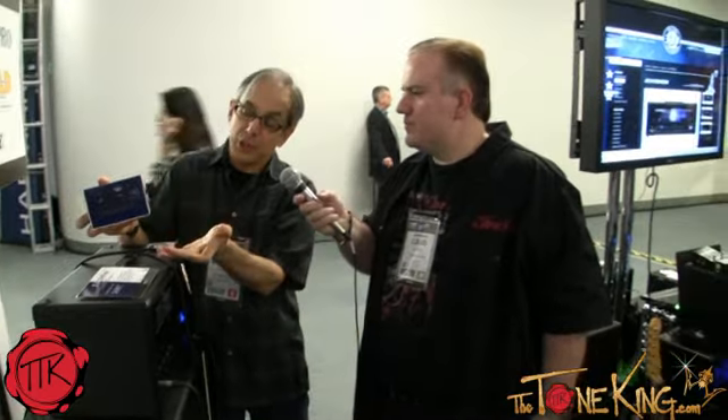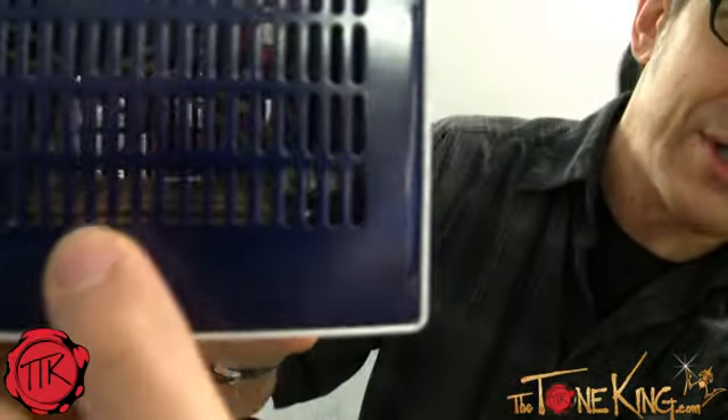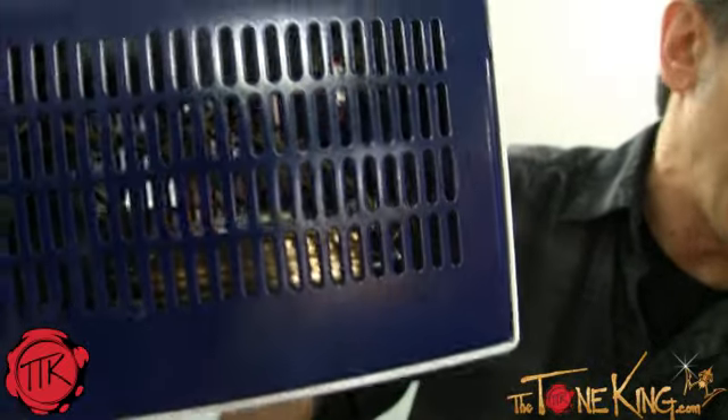Exactly, and that's a very cool thing about this. It kind of acts almost like a buffer between the amp. So once you're plugged in, you just put on your guitar and dial in to play. If you want to use it strictly as a load box, you just put this on zero — and it's a load box. And if you want to use it as a recording load box, again, this on zero, bring up your line level, which you now have plugged into either here or here, going into your board with the mic sim, or into a power amp or something else. You can use the line out. So it's just a really nice, user-friendly, foolproof kind of deal. And it's good for up to 100 watts — we use these big metal-enclosed power resistors, which are what you'd find in more high-powered attenuators.